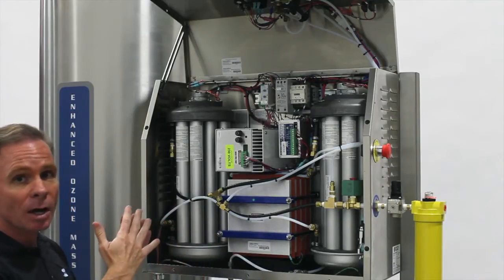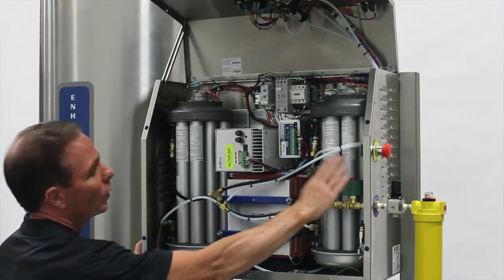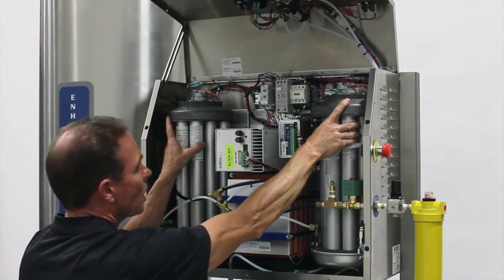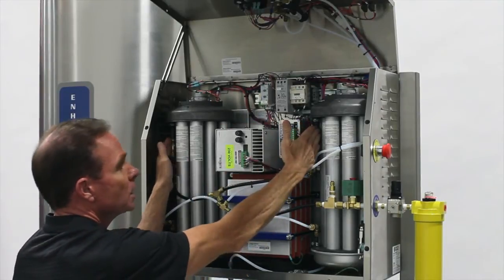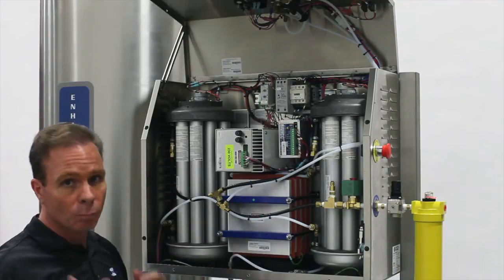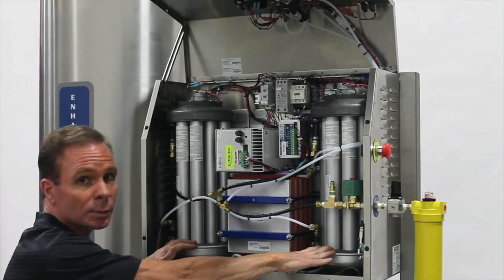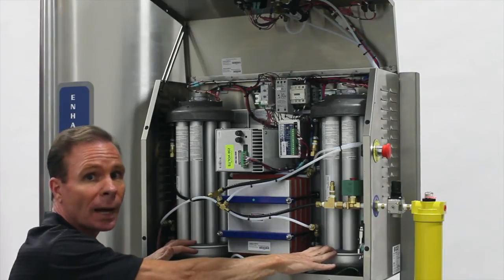It's very important that we do not pressurize the oxygen concentrators when they do not have electrical power available. When the ozone generator is switched on, this solenoid opens, allowing the compressed air to be distributed through this T to the two oxygen concentrators. Both oxygen concentrators are mounted in parallel, so they both see the same amount of compressed air. The oxygen concentrators then remove the water vapor and nitrogen in the air, leaving at the base pure oxygen. The oxygen is approximately 90 to 95 percent pure and extremely dry, a dew point of about minus 80 degrees centigrade.